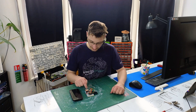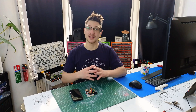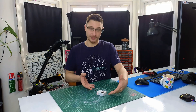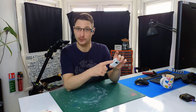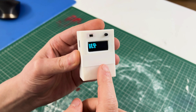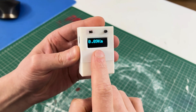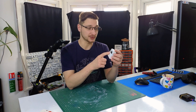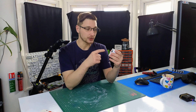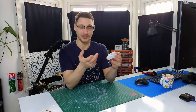The only real issue I had was that the display got a little bit crowded, but I have a fix for that, so I'm not worried about it. I'm going to design a nice little case to put all of this in and finish this up. Great news — I've decided to spare you the modeling, 3D printing, assembly, and soldering montage. Here it is. Look at how cute it is — it's like a little Tamagotchi. I've added a button and an on/off switch, and the USB for programming and charging is on the side. When you first turn it on, you've got a screen with all the information. When you press the button, it shows an enlarged version of miles per hour and kilometers per hour. Then there's a shameless plug screen, and the third screen is an off screen — so when you're charging it, it stays on but I don't want burn-in, so there's a button that turns the screen off while the GPS module stays active.